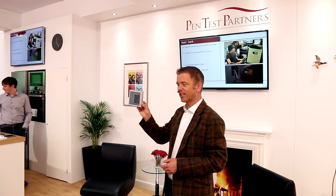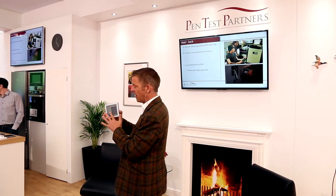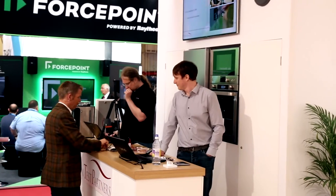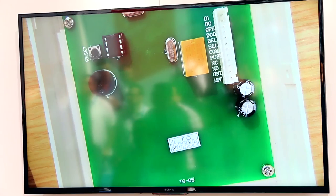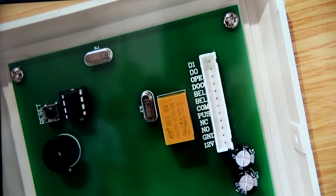This is a smart door lock. I bought one on Amazon a couple of weeks back. It's got a pin pad on it and an RFID interface as well, and you can use it to control a magnetic door lock — except that it's secured to the door with one screw, and once you've done that, you've got access to the back plates. On the back there, can you see fifth from bottom is the word 'push'? So if you take the connector to push and put it to ground, it unlocks the door. Seriously, is that nuts?